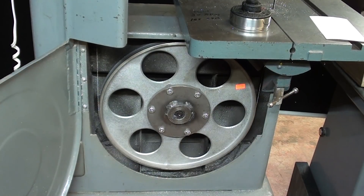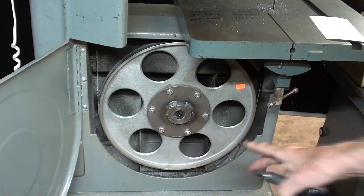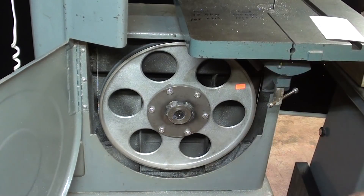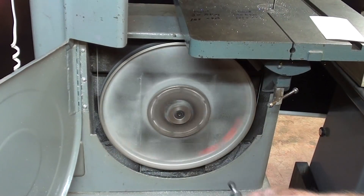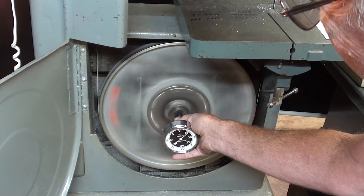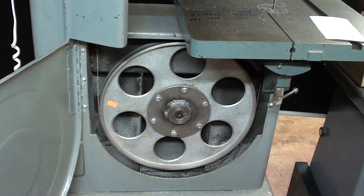Now watch how fast it runs in direct drive, and I'll take that speed right off the center shaft here. Be very careful when you don't have guards — I don't recommend you do this; this is for demonstration purposes only. It's reading 500 RPM, and using that formula, you can determine that is 1,750 feet per minute. And that is the speed for cutting wood — maybe not even fast enough for some wood.